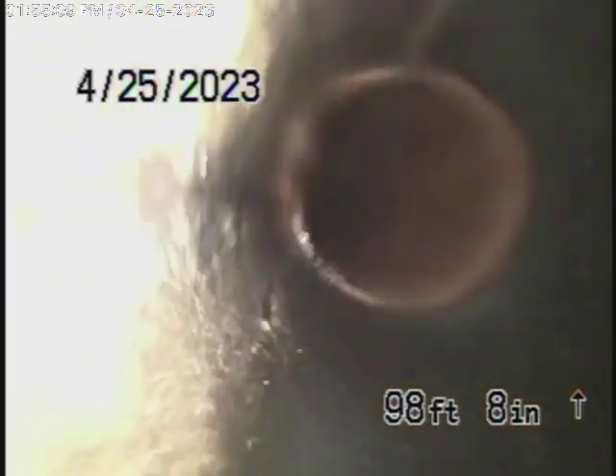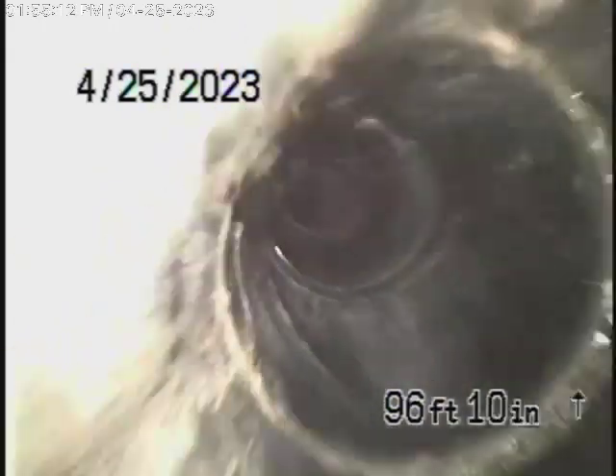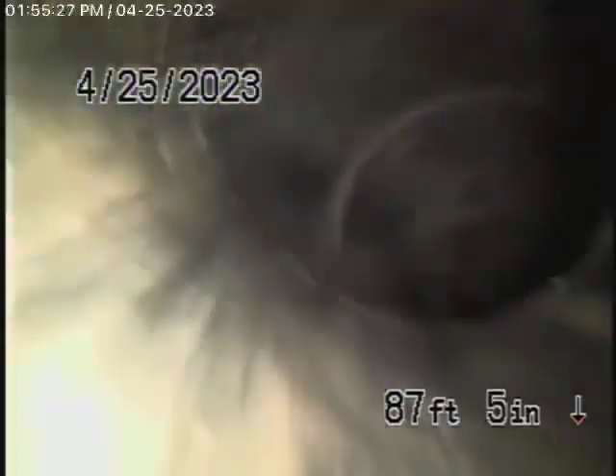We're probably very close to the six-inch lateral. It was obviously shifted a little bit, and there's no way we could get past that spot because we just don't have enough clean-outs available. You can see the pipe has been very clear though — it's made up of ABS plastic and clay pipe, all in good condition. There are a couple of connections along the way, and apparently a couple of houses are connected to this line downstream. It goes through the property in a southward direction.